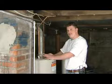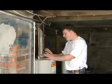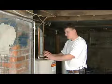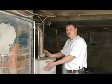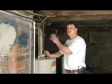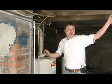One other option they have for these hot water heaters is a power vent method. The power vent method is more efficient by ten to fifteen percent and it comes with a fan built on the top of your hot water heater. That fan kicks on as your burner starts, sucks your fumes up, and then you can run it through a CPVC or regular PVC pipe which vents out the side of your house.